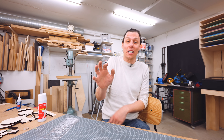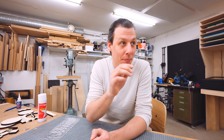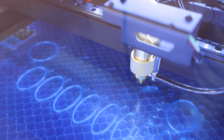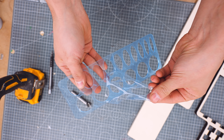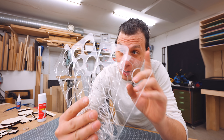But there's a lot more really cool stuff you can do with a laser cutter. That got me thinking back to the very first time we got a laser cutter at my own design school — that's about 8 years ago now. One of the first projects I did there was to cut out some elliptical drawing templates. And I also cut a whole bunch of these on this machine. These are cut out of clear 2mm acrylic. I've engraved the size and the percentage of tilt of the circle. I cut out all four of these in about 7 minutes, including engraving.